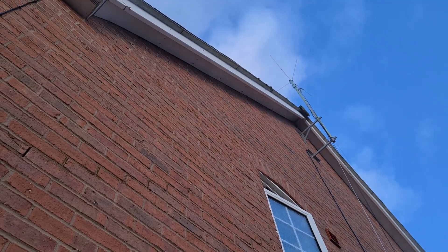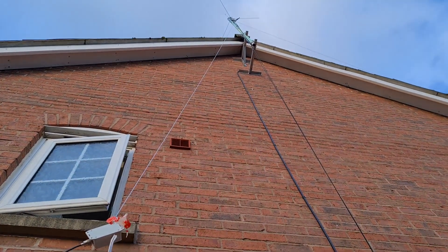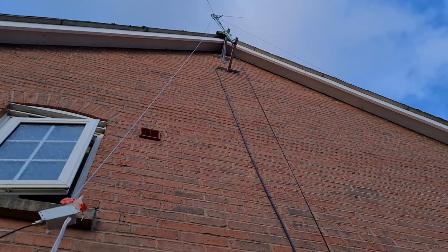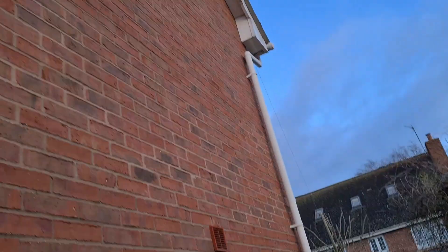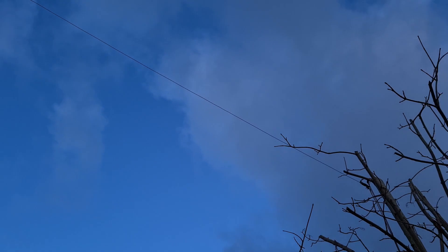The first thing I thought about was: is this wire in the best position? As you can see here, I've got my UHF/VHF white stick — a Diamond X200 — on the roof, a couple of metres above the roofline. Before I erected it I put on a pulley system with paracord so I'm able to pull up any wire I want. In this case I've pulled up the end-fed wire. There's a danger there — there's a lot of ironwork up there, and the pole it's on is also metal. Running an antenna too close to a metal pole can create a very strange SWR, because the metal essentially becomes part of the antenna.